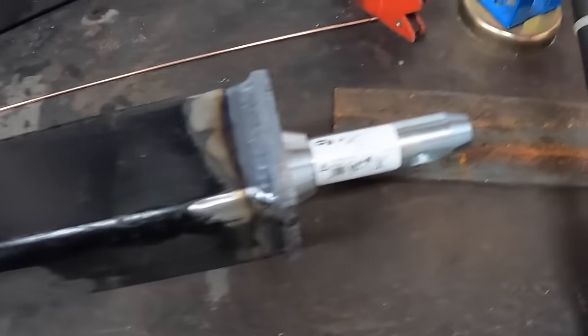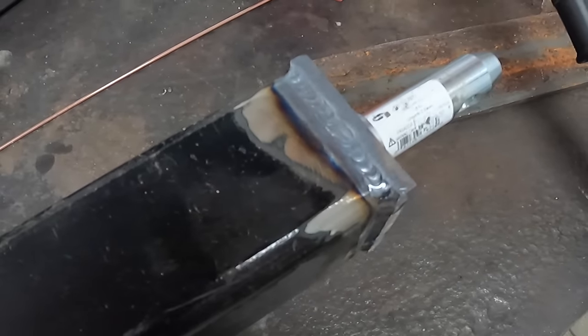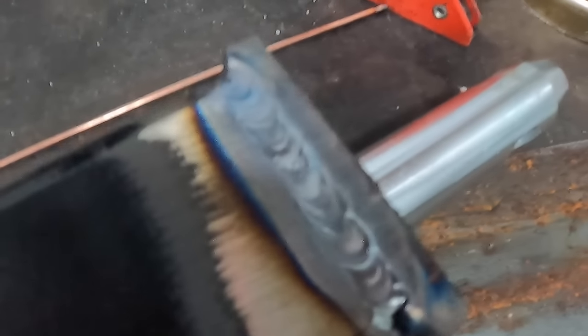Okay, that went pretty well. Keep in mind, I'm not a welder, and I've only TIG welded one time on scrap steel so far. So this is a test. So it looks all right. This first one I did, I was going a little slower, and I have a lot more undercut, but it penetrated well. They're no stack of dimes, but I think they'll work.